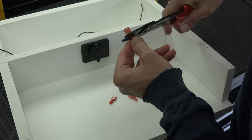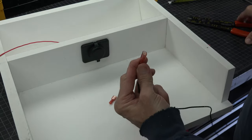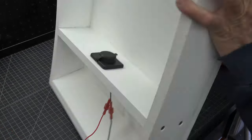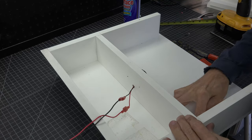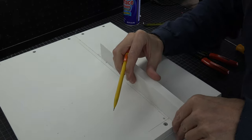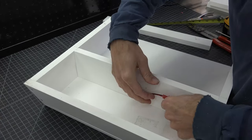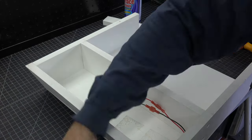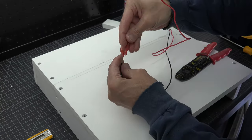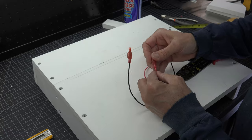I needed to extend the wire on the back of the USB port to ensure they traveled all the way outside the box, so I joined the back with some extra wire and added connectors to make the job of installing the box a lot easier. I used the marks from the centering cut to put my feed hole perfectly in the corner, but when I flipped the box over I realized I put the hole on the wrong side of the cross support — what an amateur. So I drilled out the correct side and filled the other with caulk. I placed some duct tape over the wires after feeding them through the hole to keep them out of the way when I push the cup holder through. I placed connectors on the end so all the owner has to do is feed the wire into the connector and crimp it down.